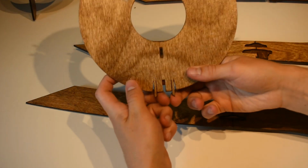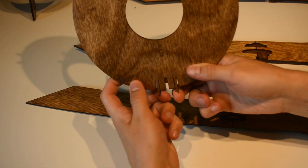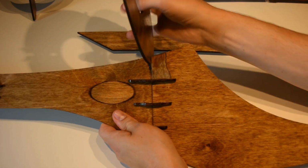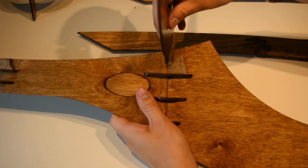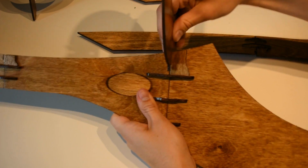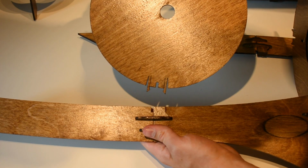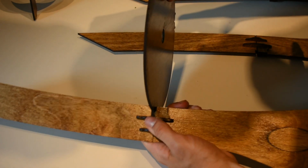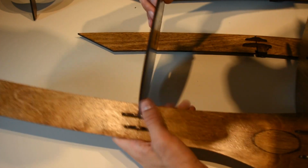The joints on each of the platforms are made so that they pop onto the side. It ended up a bit crude, but this helps make sure that the platforms won't slide off from the vertical pieces without making the joint permanent. That way the tower can be disassembled if you ever want to store or move it. The basic process for assembling the tower is to snap on both of the platforms on one of the tower segments, and then carefully snap on the other 2 segments to the platforms.